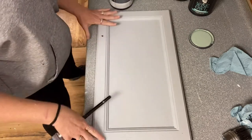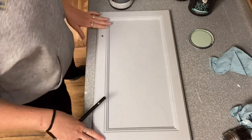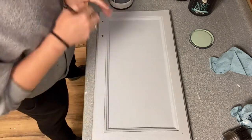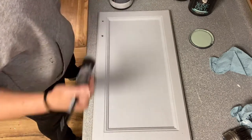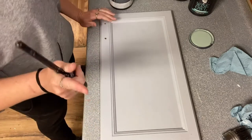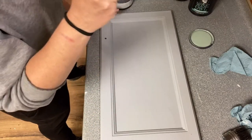If you are working on a flat surface, you're going to want to paint just flat with the grain of the wood. Follow the marks that you did with your primer — don't go crossways. On top of that, I'm going to show you a trick for when you're working on the actual bases of the cabinets and working on a vertical surface.